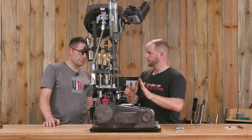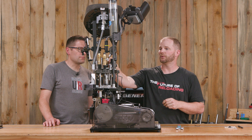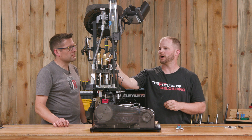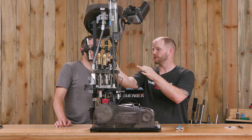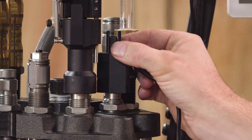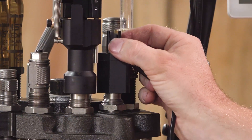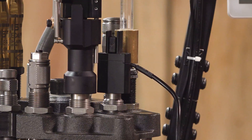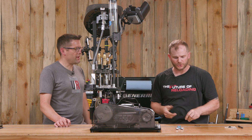With the sensor installed, adjust the height of the die body so that with a proper powder charge, the rod is flush with the ears of the housing. What's cool is this also functions as a mechanical visual check — when the rod is flush, you have the right powder. If it protrudes above the ears, that's an overcharge. If it sits below, that's an undercharge. Think of it like a height sensor — that's an easier way to think about it.